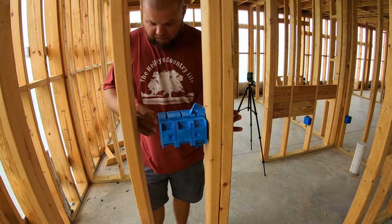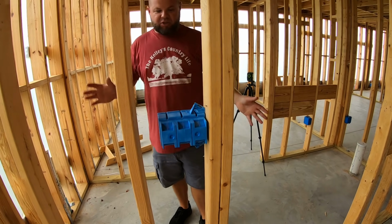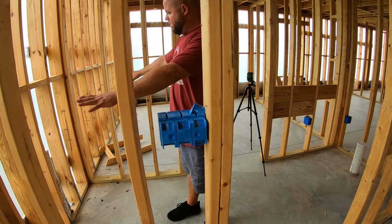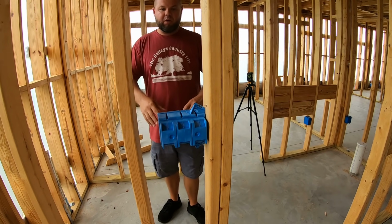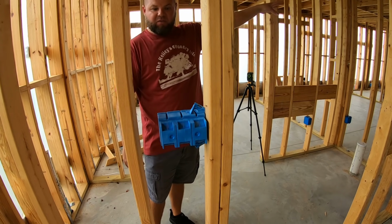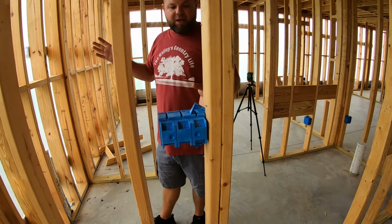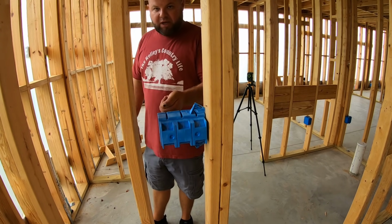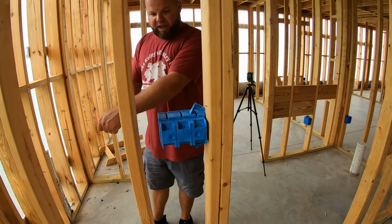All right, now this is the kind of stuff that drives me crazy. So I just put a 3-gang box in here. This is Tiffany's half bath slash get ready room. We're going to build her basically a powder room right in here. A big vanity here that she can slide a chair up underneath, mirrors so she can get ready. So we needed a 3-gang box, one to turn on an overhead light and vent fan, two to turn on very bright lights right here for her to get ready, and three, I want to put a GFI outlet in right here so she can plug in hair dryer or curling iron. Her vanity stops about right here, so she can plug it in and actually just lay it right here.